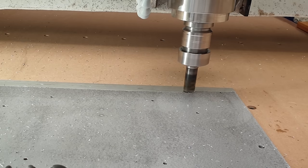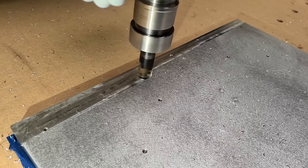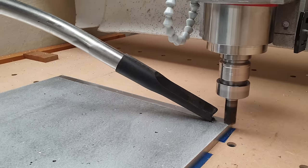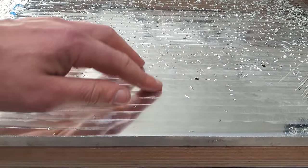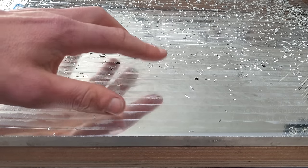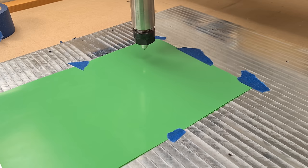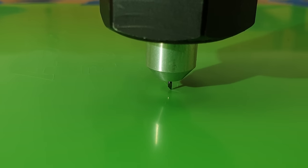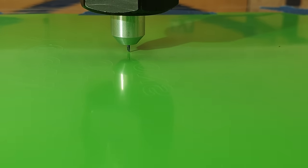After wanting to make flat square surfaces and finding clunky workarounds so many times on this build, gratification has never felt quite so circular. That is a very nice finish — I can't feel any lines whatsoever. Just look at that grubby reflection there. Indeed, that plate became flat enough that we were able to cut exactly halfway through a 0.2mm thick piece of vinyl with a bodged-up unsprung drag knife.